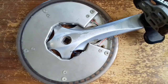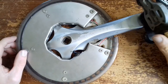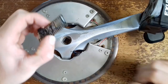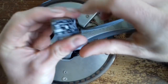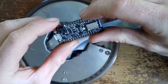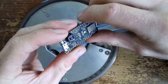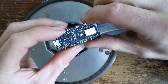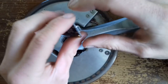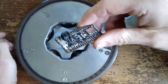So is it possible to make a really cheap power meter? Yes — but if you want 1% accuracy, then buy an expensive one. The next level I want to take this project to is to use one of these Bluefruit Feather NRF52832 modules, which is capable of transmitting ANT+ and Bluetooth Low Energy. It's also got a better resolution ADC, faster processor, and onboard LiPo charging. That's what I'm excited to do next, to take the power meter project to another level.